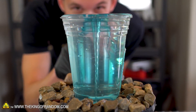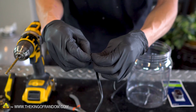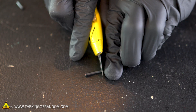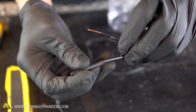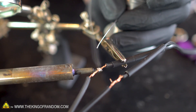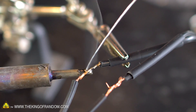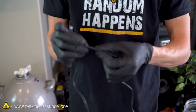In the video where I showed how to build a desktop vortex fountain, some people pointed out that my cord splicing technique was pretty poor. So I've tried to upgrade and improve it to be a little more safe. Instead of just twisting the ends of the cord together, I'm going to twist them, then solder them, then heat shrink them together. Those pieces are now nicely soldered. We'll slip our heat shrink over the soldered parts, and then wrap a little bit of electrical tape around the joint.